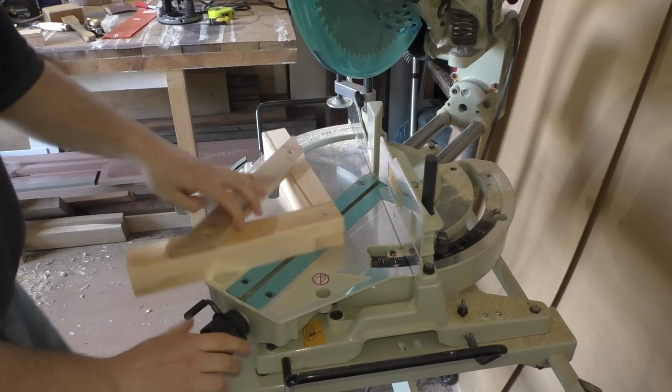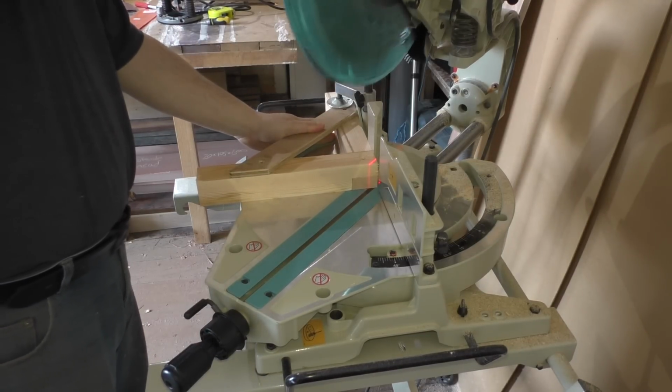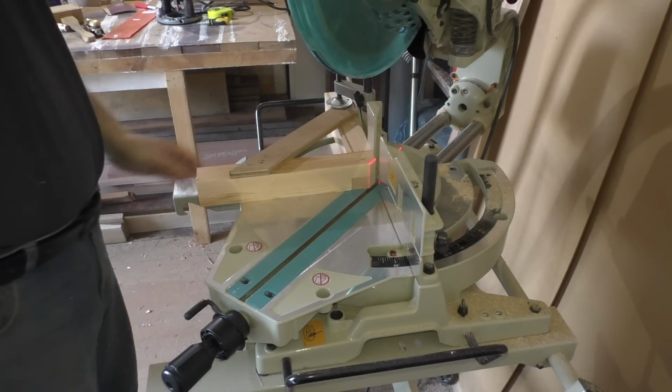Trimming the corner off the clamp is a good idea for two reasons. Firstly, you don't want it catching on anything in the corner and not sitting correctly, and secondly, you'll be using this during glue ups and you don't want it getting glued into place by squeeze out.